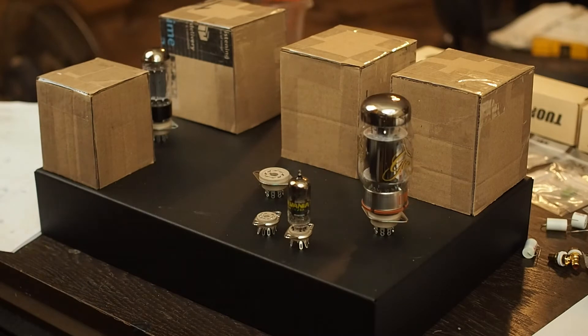It's a very similar design — uses the same transformers, choke, and everything else. It's just got a different driver front end. They were both designed by Kegger. He said he likes the way this one sounds better. If I decide I want to go to the design that the Blue Glow amp was, I simply have to redo a little of the driver wiring and change out the front end tubes.